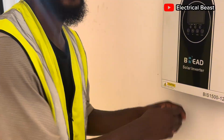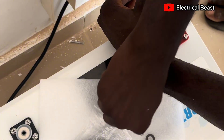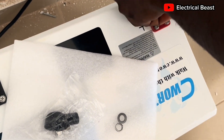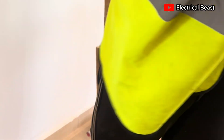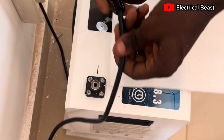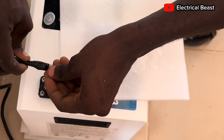Next I'm going to connect the batteries. This is the CWatt 2.5kWh lithium battery. Here I'm connecting the positive terminal of the battery. It came with accessories such as Allen keys and nuts. All you have to do is get a cable lug, connect it to the battery cable, and connect it to the battery. I use red tape to indicate the positive side. For the black wire on the negative side, just do the same thing — connect it with the accessories that came with it: the cover, Allen keys, bolts, and washers. Ensure everything is firm and very tight.